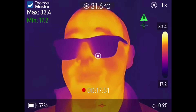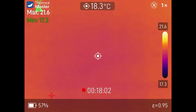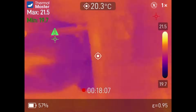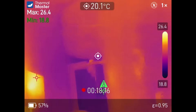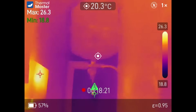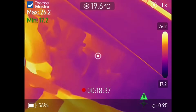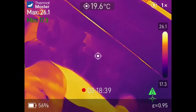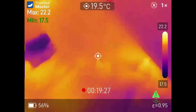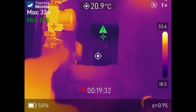What are you thinking so far? Is this the way to deal with your heating system turn-on? I can hear a bit of airflow. What's the system pressure looking like? Because we've bled out so much air we're down to one bar, which is not terrible, but we're going to top that up to about one and a half bar. There we go — topped back up to one and a half bar.